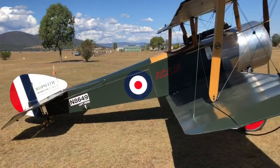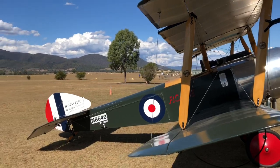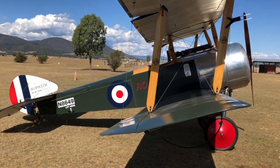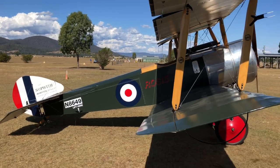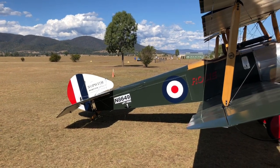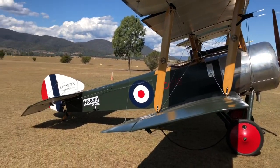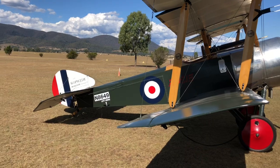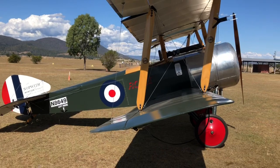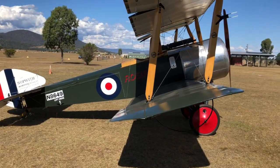Nice. The main issues that we're finding is when we're landing it. So power's off, airspeed's low. This thing cannot handle any crosswinds at all. Basically, there's not enough rudder surface area there to do anything. It's basically there to look cool. Does nothing else. As the tail starts to come down, you're losing any authority you have over there, and then she'll go right. Unless there's a crosswind, and then it'll go left. If it goes right, that's a good thing.